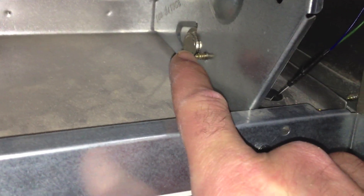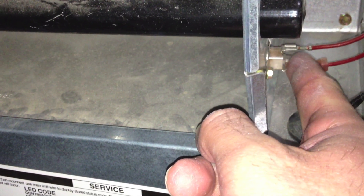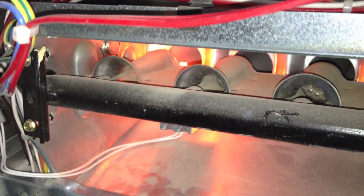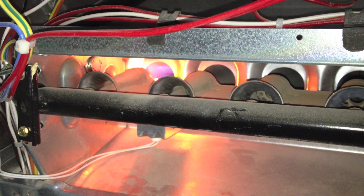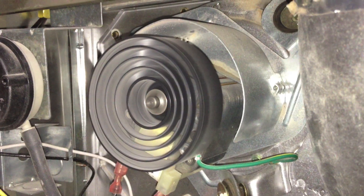There's a sensor there. In case fire starts coming out where it shouldn't, this will switch — and there's a little button there to reset it on that one. You can see the glow. You're going to get some heat coming out of the glow thing so that when the gas starts going, it immediately ignites. Gas is going to turn on — there it goes. That's the exhaust blower.